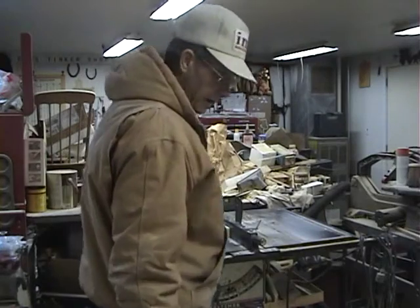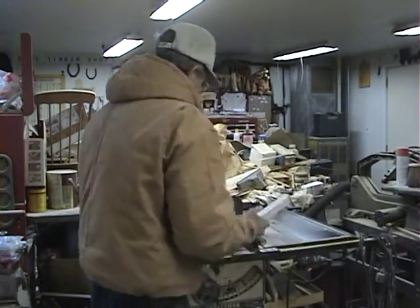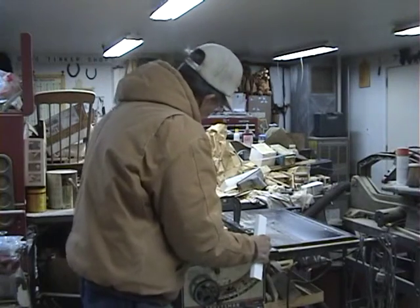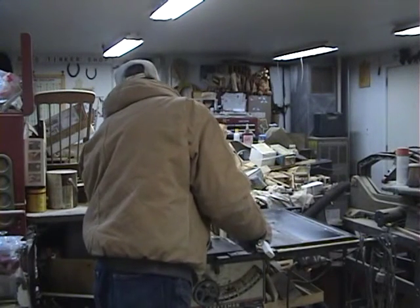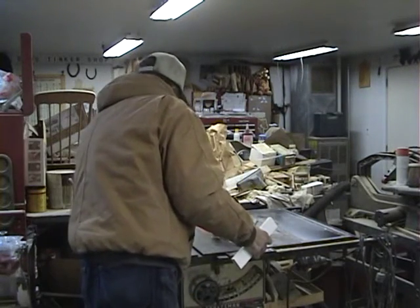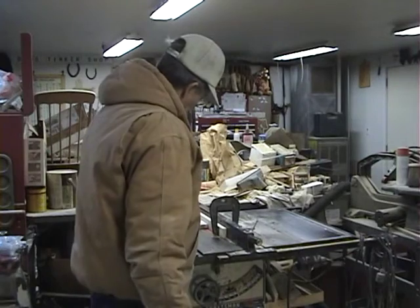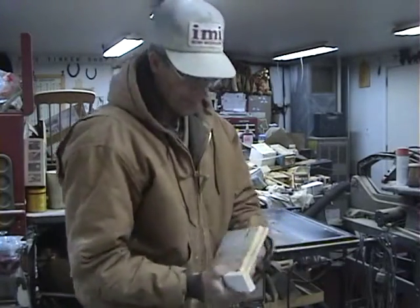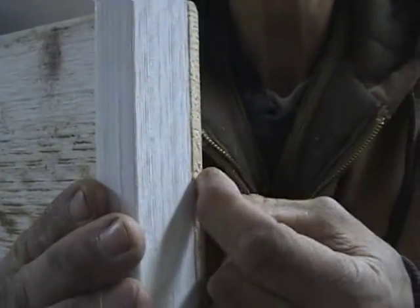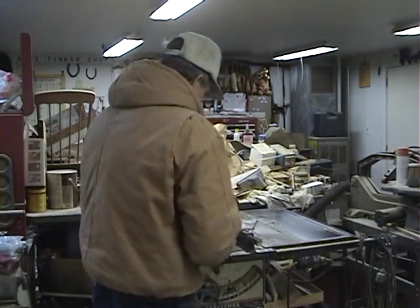Now we want to set it to the thickness of our board. This is an end board — this happens to be a feeder. You can just start out anywhere, just gap that for a time. Start your saw up. I had it set just a little bit too deep — you can see there's just a little fraction of the board sticking out. You want to set this to the depth of your stop and you're done.